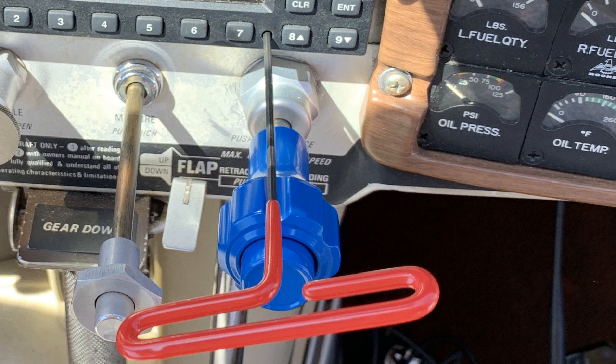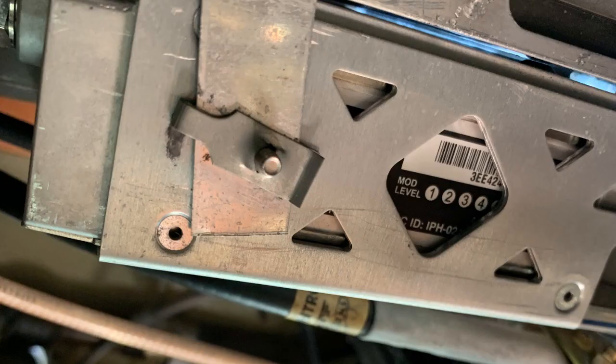When tightening or loosening the hold-down screw, use only very gentle force because it's possible to break the screw and end up with another repair. They are replaceable, but don't let it come to that — ordinary tightening should be good enough, just snug. Here it's possible to see the transponder in the tray from way back under the panel, and you can see part of the transponder sticking out beyond the back of the tray. That's the cooling fan manifold on the left. After the hold-down screw is loose, just push the escutcheon towards the front of the tray and the transponder should slide right out.